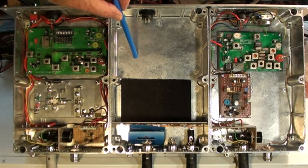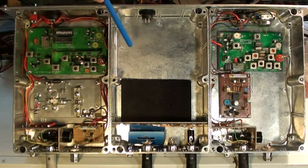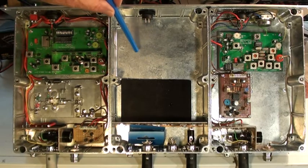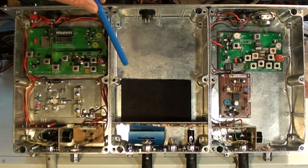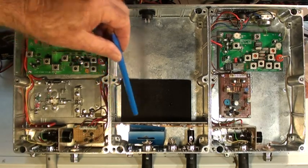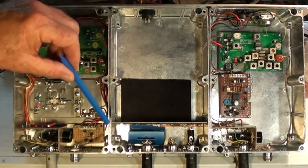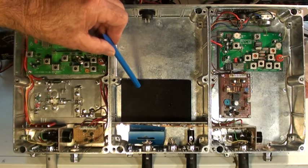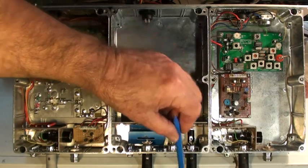In the centre, the NHRC4 controller has not yet arrived, but it will go there. I've also ordered a proportional squelch, which changes the mute tail so that weak and fluttery signals don't get chopped up as much. You'll hear a lot of noise, but the signal will still hang in there. This is just the copper screen, and there's a range of feed-through capacitors along there. The connections will be made from here across to the controller.